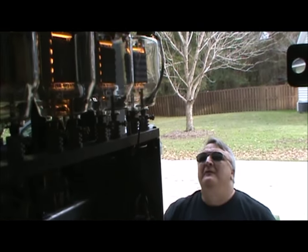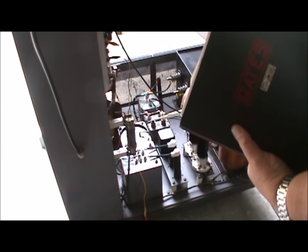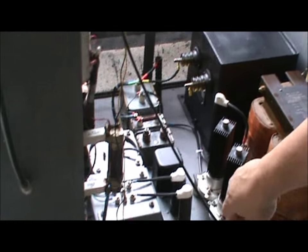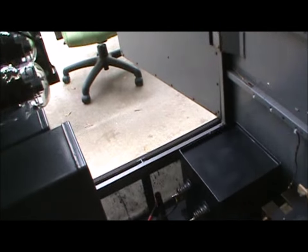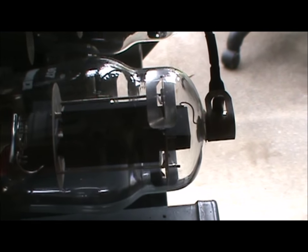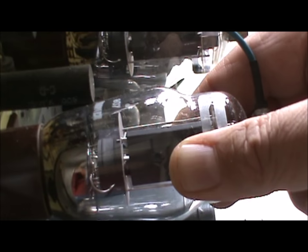All right, I have filament voltage a hair under 10 volts. Let's let this sit for a minute. It's running — shorting it to ground right now, something known as a Jesus stick or a chicken stick. All right, we had one tube that did not light — all the 833s were good. This one tube here did not show any filament; it might just be a bad connection or a bad tube. We have a spare tube — swap it out.